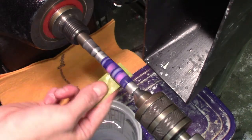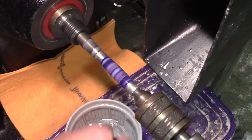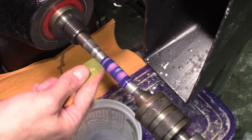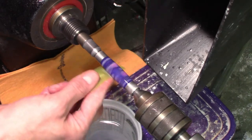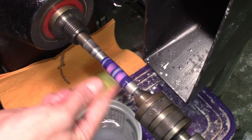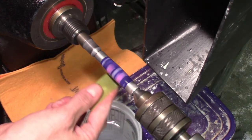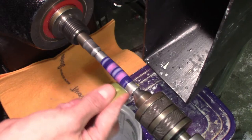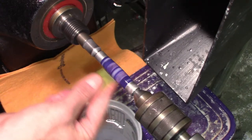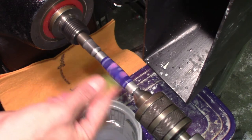And I found that UV resin, the 3D printing resin, photopolymer, polishes up pretty well too. Again, when you're looking at those specs, you want to go with something that reaches somewhere near Shore 80D on the hardness scale. That'll help make sure you can get it nice and polished, glossy. If it's in the range of 78 to 82, that's about the same as Alumilite Clear Slow and most of your epoxies. They're all in that 80D range. So it'll polish up nice, it turns nice.